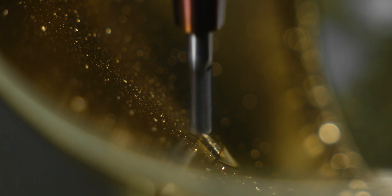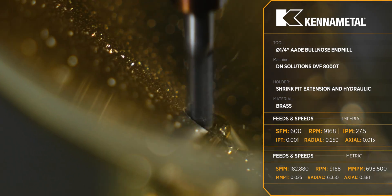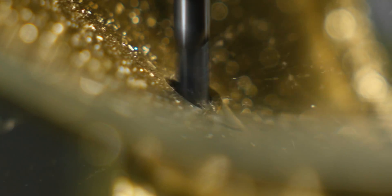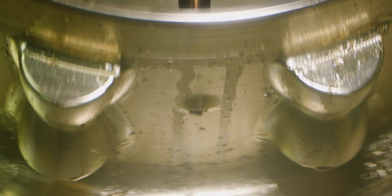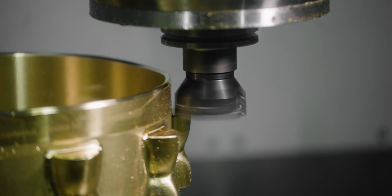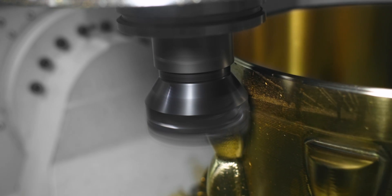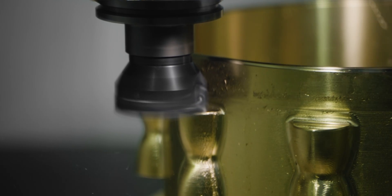Next I'm going to come in with a quarter inch end mill and helical mill the vent hole. Then I'm going to come back in with that three-inch shell mill and semi-finish around the top of the lugs. This is not taking it down to size — I'm still leaving 25 thousandths stock on here because I want this finished all together on the next operation, and again you're going to see why in the next video.